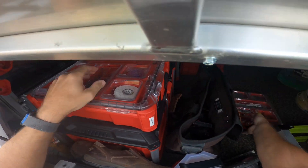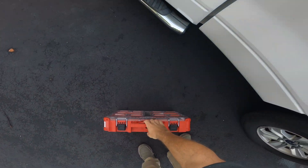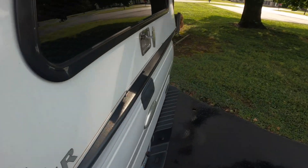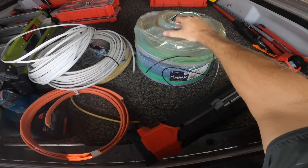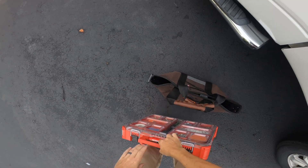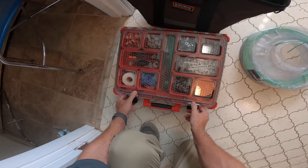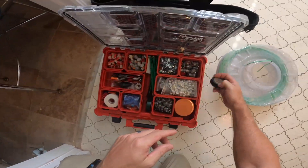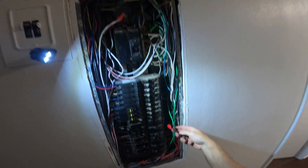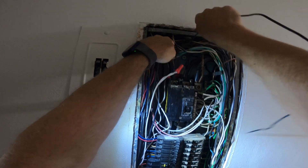Now I'm going to get out the supplies I need to do the work. I'm getting out my electrical packout box and also my Veto bag — I use that to carry stuff in and out of the house. I also have a coil pack of green wire and a coil pack of black, white, and green in case I needed to run all three new wires. But I'm going to use the black and white already in there and pull out one of the blacks and replace it with the green, so my ground conductor will be a green wire and not a taped black wire. Now I'm going to pull the other black wire out through this mess.